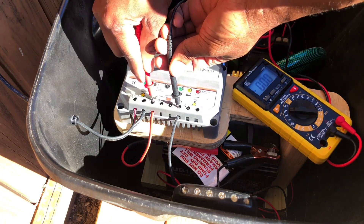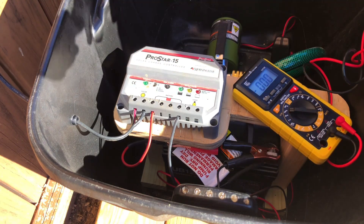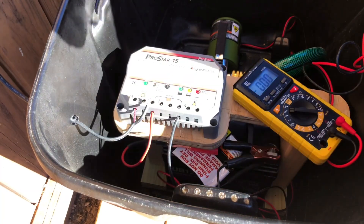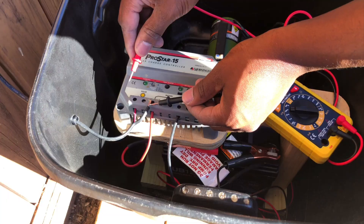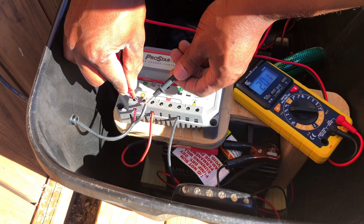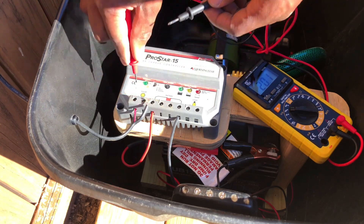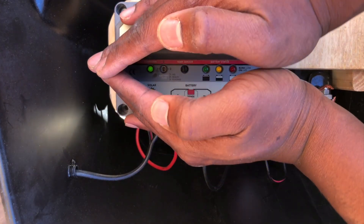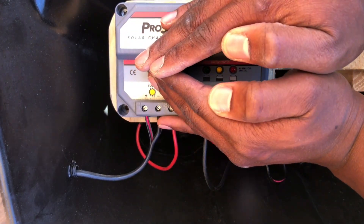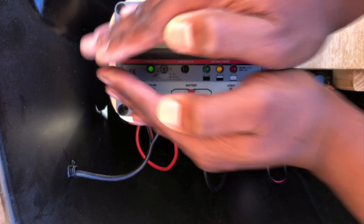Before moving to the final stage, I needed to verify the voltage readings for both the battery and the solar panel. To test my solar panel connection, I needed to temporarily disconnect it from the solar charge controller, otherwise the voltage reader would display the reading from the battery. It was a good sign to see that I was receiving about 20.1 volts from the solar panel. After about 20 or so minutes, I noticed the battery was now showing a status of yellow, which was a good indication that the battery was indeed charging properly.